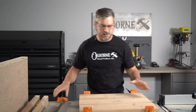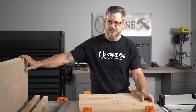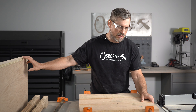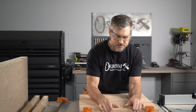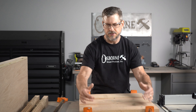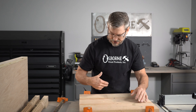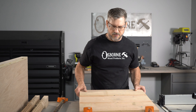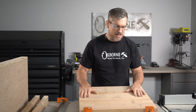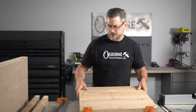I made it a little bit oversized, so I'm going to double-check my measurements and see exactly what I want on my overhangs and get that figured out. I have a nice saw cut on one edge that I can just build my squareness off of. I'll pick which end I want to cut the excess off of, then we'll get that sized, belt sand it, and get it ready to put on.